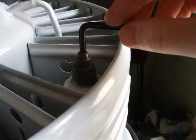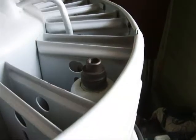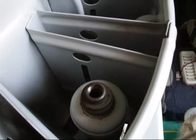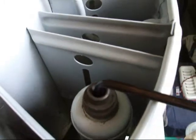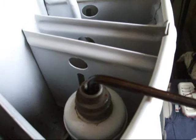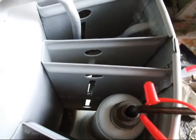I've already loosened this one before, but just to demonstrate how it's removed. And down in there is the main sealing screw, which fits the same key. Now the next thing to do is to put a few drops of oil in that. I'm using 4GS refrigeration oil, but you can use any fine, clean mineral oil.